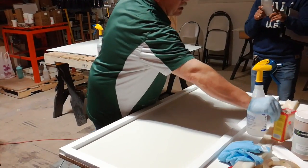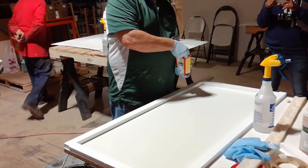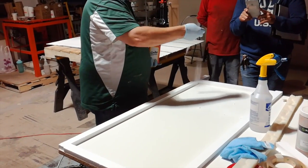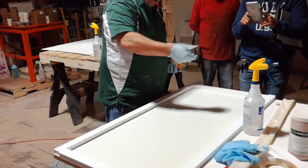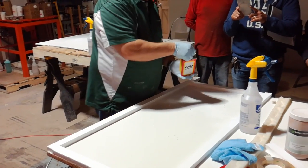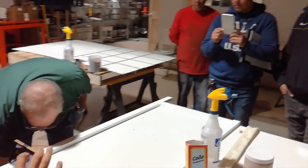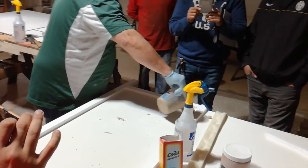I'm going to go ahead and sprinkle the baking soda out on it. Remember — big chunks make big holes, a little bit, not so much. When pouring on a regular mold, I'll only pour up to about a quarter inch. You don't want to take this product much more than two inches — it's not meant to go out that thick.